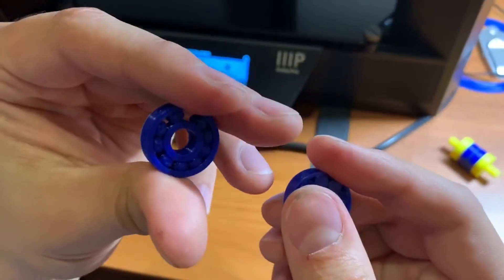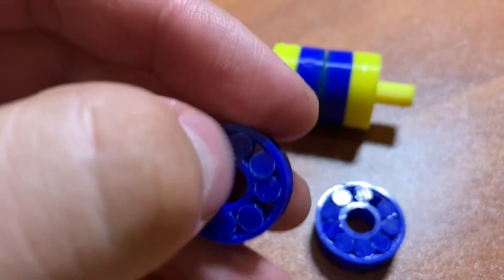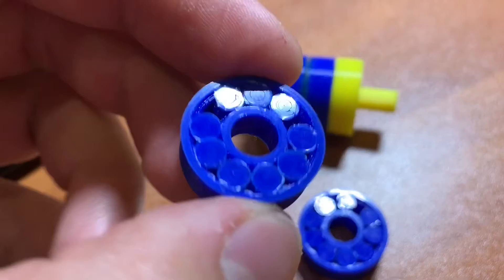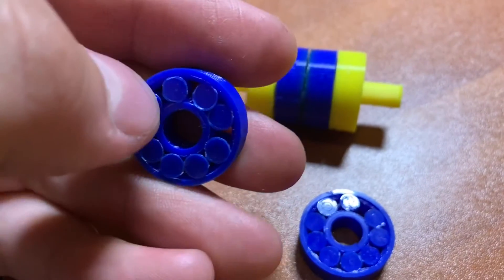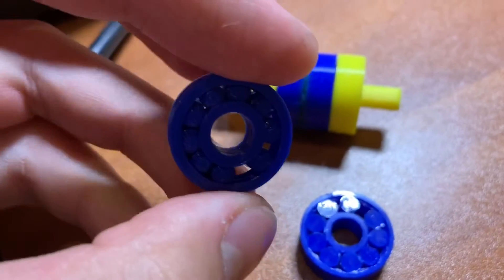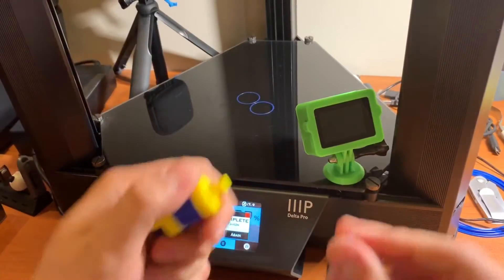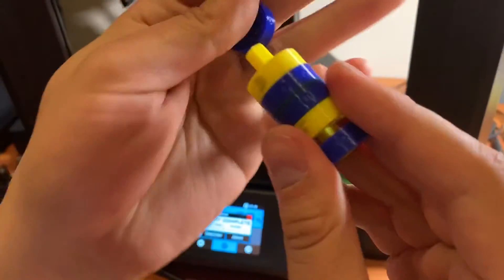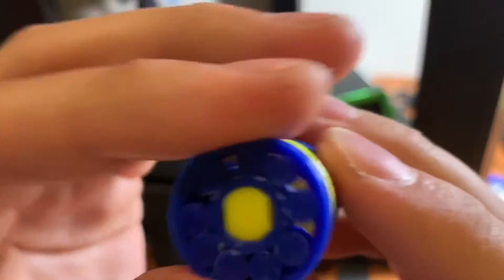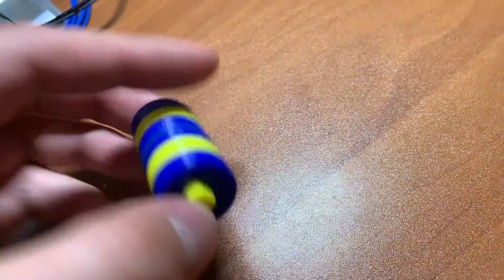So this one's a bit stiffer, and this one came out easier. Just to reference my last statement about the heat gun — you don't always need it. I brought it closer to my body, focused a little bit more, and pushed it through. The thing is when you have a glass plate it heats up the bottom layer and sometimes it spreads — it's called an elephant's foot or something like that — so you do sometimes need to work around that. But other than that, this bearing is good to go. You just need to play on the carpet and in about two minutes you have a nice spinning bearing. The best way is to print the rod, put these on the rod, go to your carpet, and spin it on the carpet — that's what will give you the same spin as these ones. They all spin and you can also use that rod for storage.